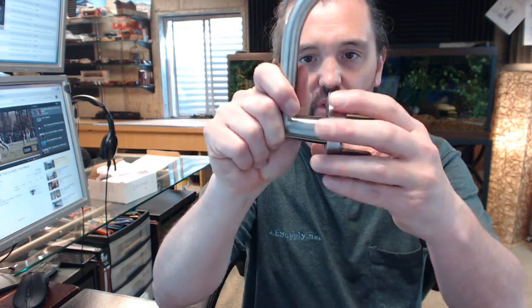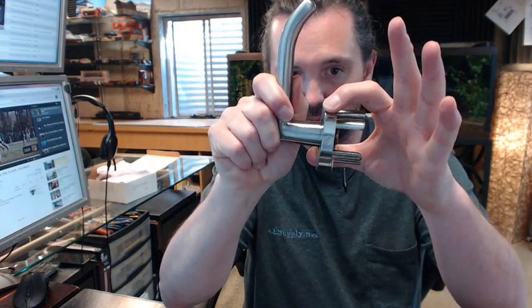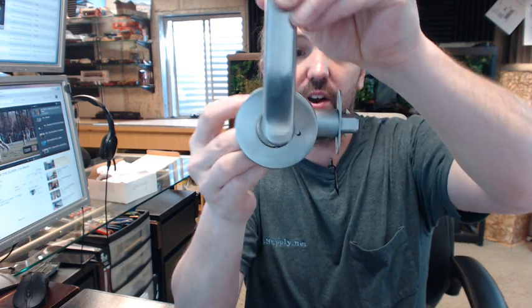This will be installed onto the door. You are going to have the thickness of the rosette on both sides projecting off of the door. So keep in mind that when you have your pocket door and you slide it open, the door is not going to go in past where the rosette is going to fall. Unless you have made some provision for it, generally your door would be hanging out of the opening with the latch sticking out as well. From this edge of the door you will have all of this assembly hanging out.